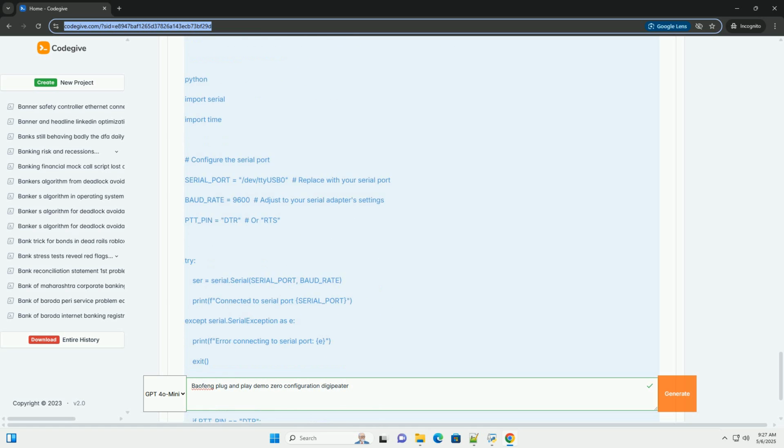Alternative approaches. Dedicated APRS radios: if you're serious about APRS digipeating, invest in dedicated APRS radios like those from Kenwood, Yaesu, or ICOM. These radios are designed for APRS operation and offer superior performance and reliability. TNC, Terminal Node Controller: a TNC is a hardware modem that handles APRS encoding and decoding. You can connect a TNC to a standard radio and use it as a digipeater. TNCs are generally more reliable than software-based modems.